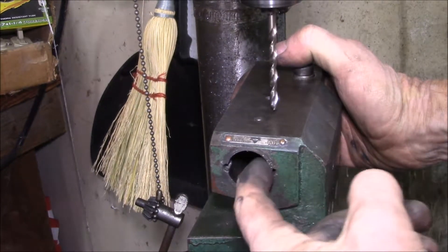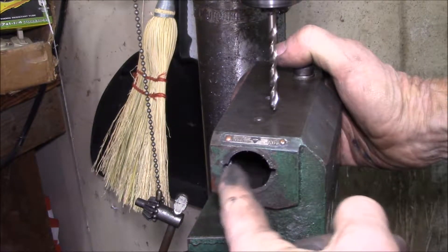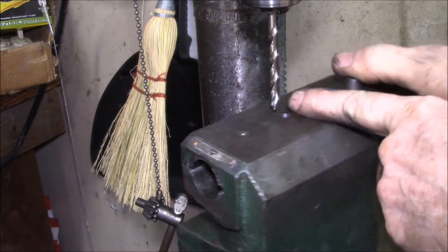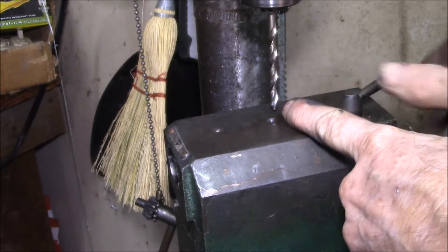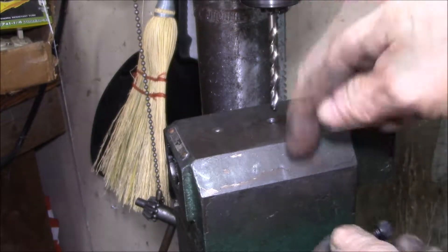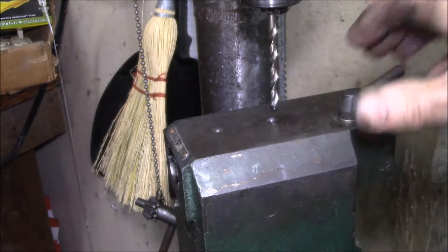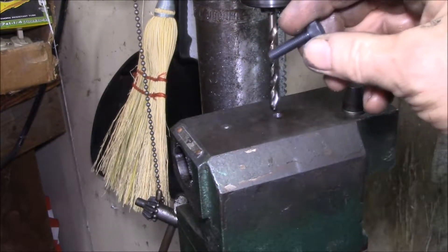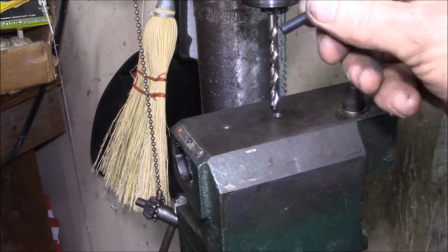Slight change of plans — to drill through the hole I've had to take out the lead screw because it extends a little bit past where the set screw goes, and you need to be able to drill through and then run your tap. I found some M6 by 1 set screws that I have and I think those will work a little better.